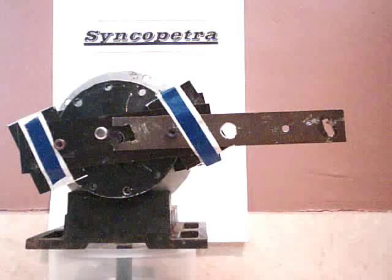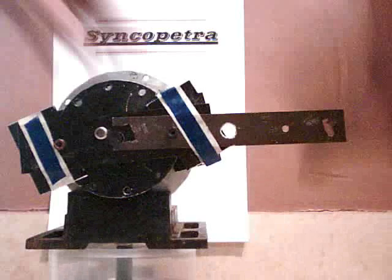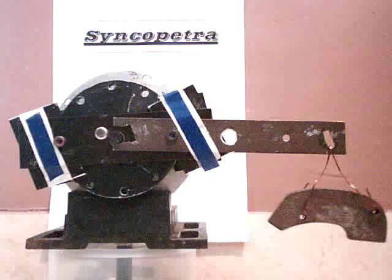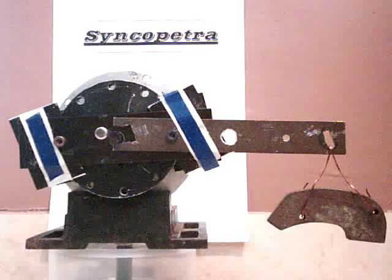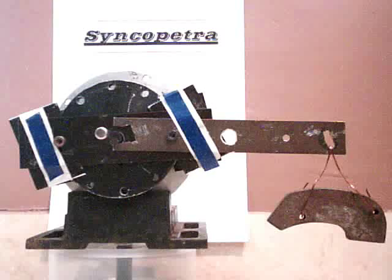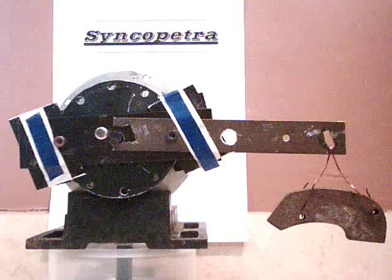So here we go. This 200 gram weight is about half the weight required for realignment. The moment arm is 155 millimeters. We added weights to the pivot point until the magnets were aligned. 400 grams at 155 millimeters resolves to 0.6 newton meters of torque, which is less than 10% of the dreaded cogging torque. The motion is small and unimpressive until you understand that it is 25% of the width of the magnets.